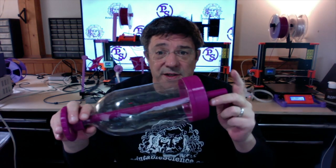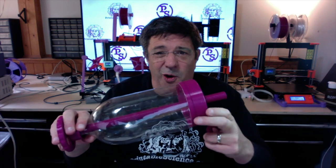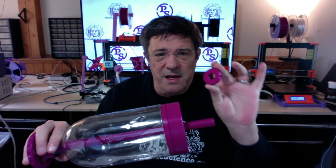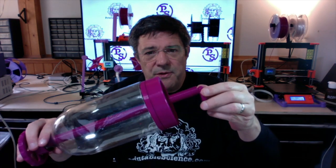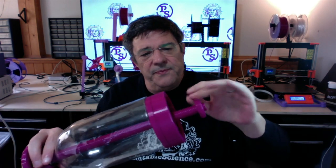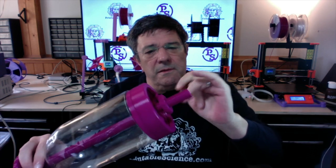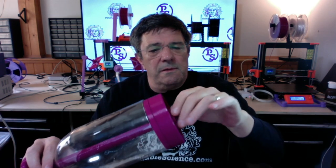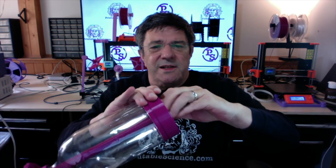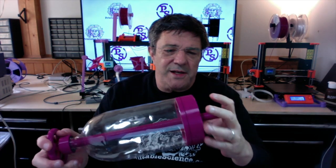There's a little bit of mechanical magic that allows you to screw the lead cap onto the soda bottle while still allowing you to freely turn the lead screw handle. In practice, even with the lead screw in place, the platen tends to wander up the lead screw while you're cutting. So just to keep it in place, I made a retaining lock screw that you can screw on tightly at the base of the platen to hold things nicely and snugly throughout the process.